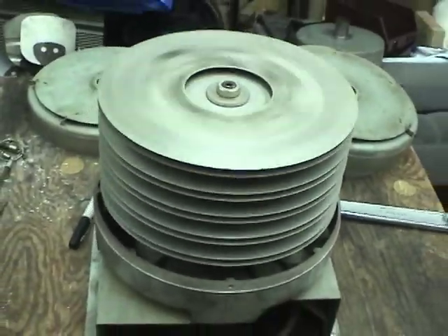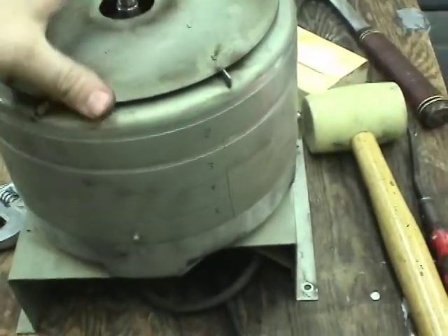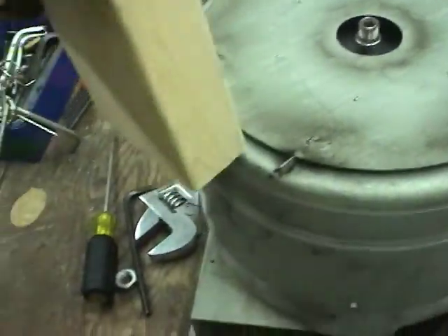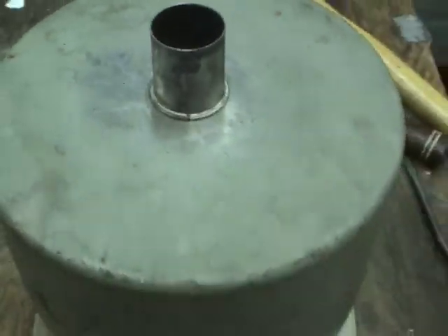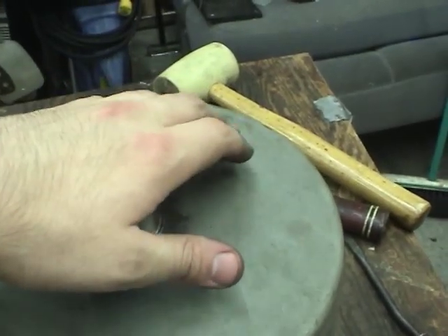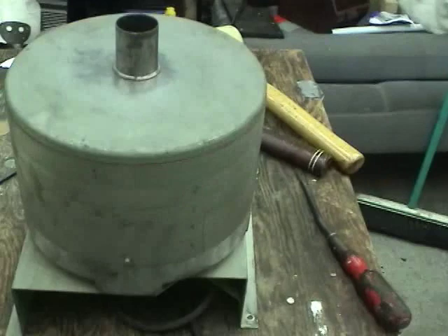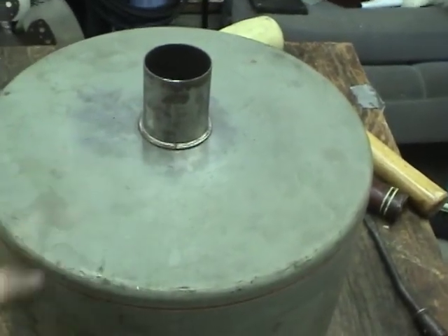Here's a test run of the motor with all the fan blades on — I was just blowing them off with the air compressor to get them all clean before putting it back together. Putting these stages back together is quite simple: you just put the fan blade on, put the housing back in place, align it about right, then put a block on it and pound it in with a hammer. It's all assembled now — let's give it a test run. That's working very well, and it seems to be blowing much more air than before. I also had to pound out the top plate — someone had dropped it on the inlet port and it bent down, restricting airflow. It's all better now.